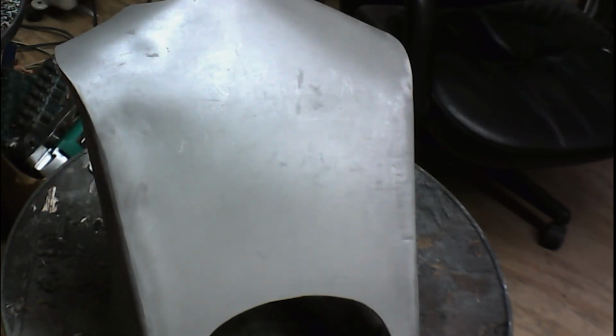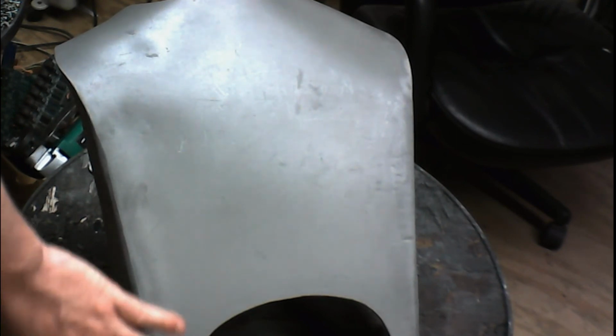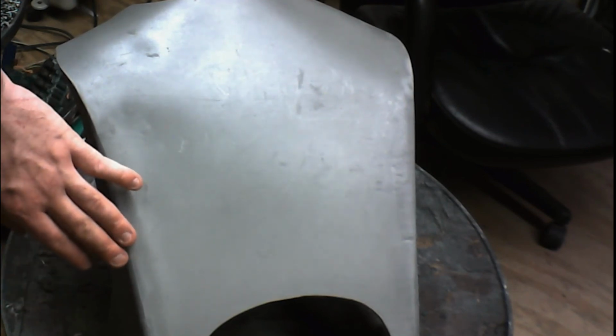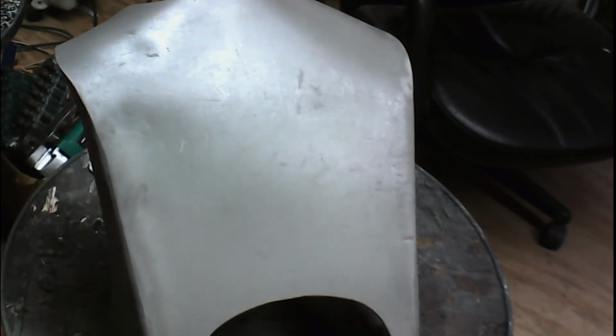Now, after we put the epoxy on there, I used my mouse sander and just switched between 80 and 220 grit sandpaper. Once I had gotten it down almost flush to the plastic, that's when I switched from the 80 grit to the 220 grit, just so I didn't blow through the plastic, because 80 grit sandpaper will definitely eat through Sintra.